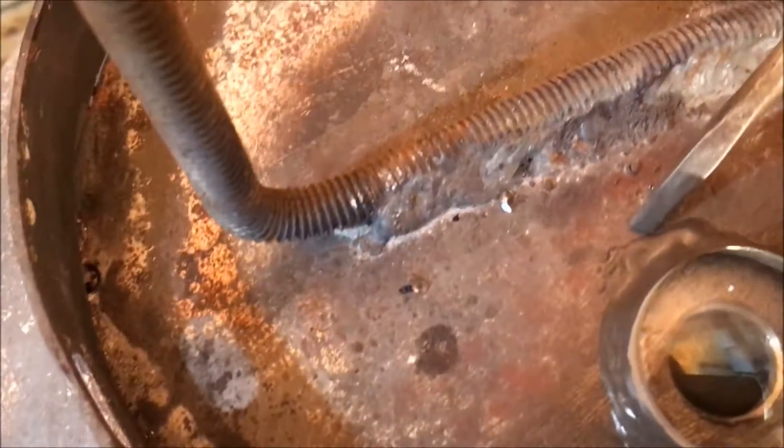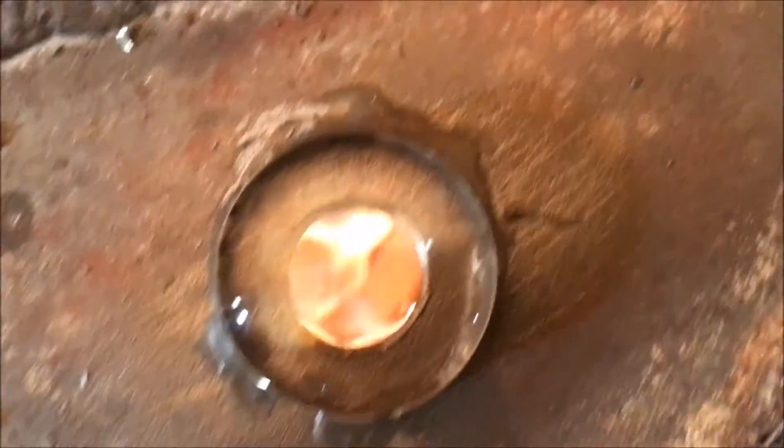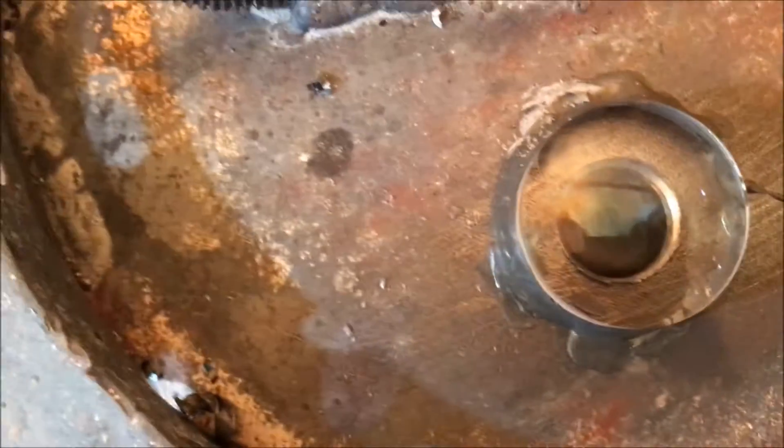Very stiff. I'm going to try to scratch some of it so we can look at it. As you can see, it's almost completely cured. I like it — I thought the JB Weld might start boiling or smoking or off-gassing, but it didn't bat an eye at 340-350 degrees. That's nearly hot enough to melt solder.